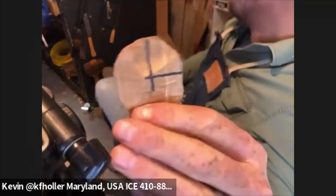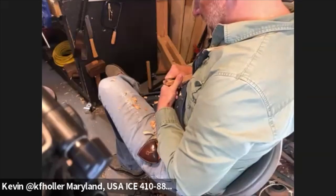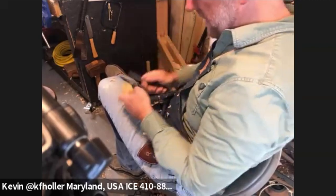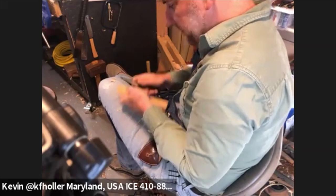I think that's a really important thing to talk about, is that's what I'm predominantly doing in this first cut through, is not worrying about the surface finish. I'm inspecting the wood on all the faces. Have you gone around? Can you see that bit of color next to my marker line that looks like a crack? I'm smoothing out the rim here. I'm going to look at it more closely in a minute. I carved a little bit of bowl to get underneath of it. And I was doing that test where you carve along what you think is a crack and you see if the wood splits right on the crack, and it didn't. But that was yesterday. So the crack might have opened up in the fridge overnight. So I'm really curious to get there.